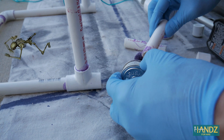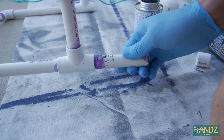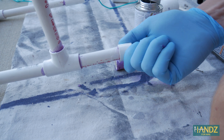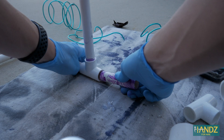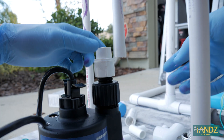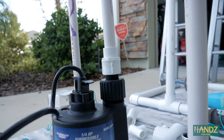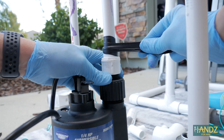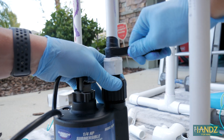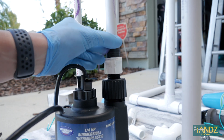I just made a quick run to Home Depot to get caps for the bottom part and a couple other supplies. I also got this awesome three-quarter to half-inch piece so I can just screw it into the top of the pump — it sits right in there. I want to be able to get this joint apart, so I'm using a plumbing wrap that makes the joint pretty strong. As I wrap this around I stretch it a little bit and it sticks to itself pretty well.